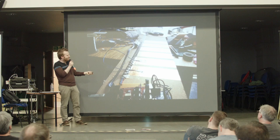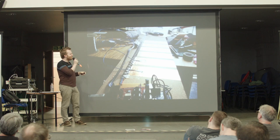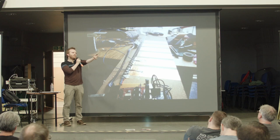And then later on, I think I got a bit neater, but I was just like, what's the best way to do this? I didn't really know how capacitive touch worked that much at the time, so I was totally winging it. If you're interested, I used the CAP1188 capacitive touch chips on the Adafruit breakout board. Really nice module. It has loads of little LEDs built in, so it's really good for debugging.